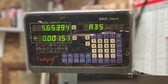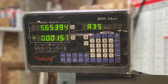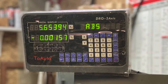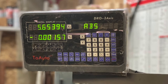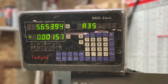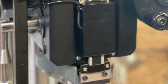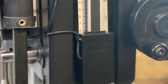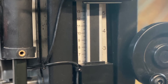This is where the struggles begin. The X and Y-axis installation for a digital readout on virtually any style mill is relatively simple. The Z-axis — which is the up and down of the quill — is another matter altogether on a round column mill. A lot of guys have a real problem with this, so what they end up doing is going with a two-axis DRO and adding a beam style or sliding scale style DRO for their Z-axis. But even that, I've seen a lot of guys really struggle with it — some real messes trying to get these things mounted.